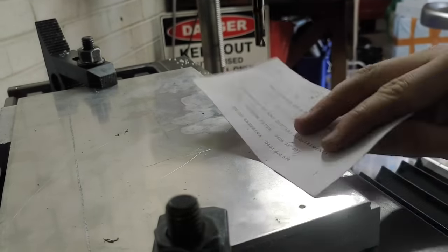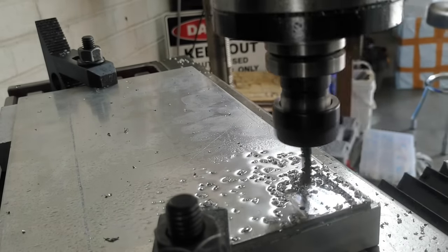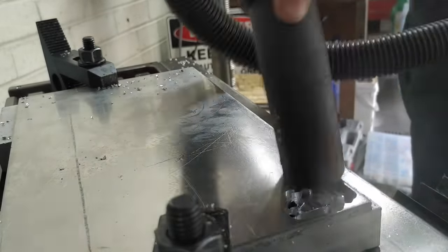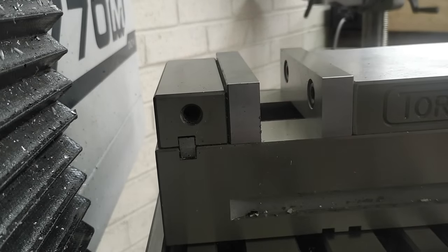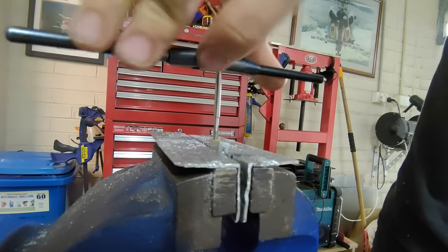To mount the wedge, some small aluminium blocks were decided upon. Tiny parts, so they could be made from 6mm plate. Once the profiles were made, we bring out the vise. This holds parts for edge drilling to suit those mounting holes drilled in the polycarbonate. Drilled, tapped, and the wedge is done.